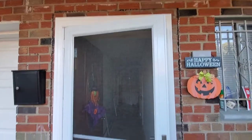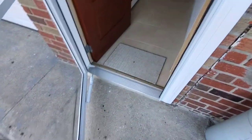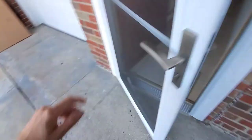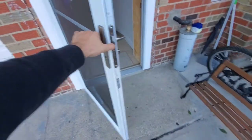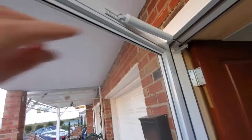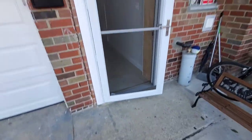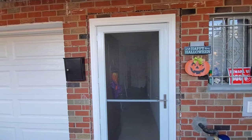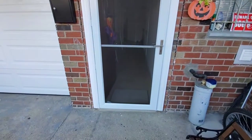Right now the screen's on, I didn't put the glass on yet — I'll try that later. The lock looks good. Final thoughts: be careful with this part of the jamb — make sure you tuck it before you drill the holes so the tongue has something to latch onto. Also, the door does not open all the way anymore — if you need a full opening for a delivery, take off these pins and reconnect after. It's supposed to install in 45 minutes, but I'm thorough, so it took me about two and a half hours. A lot of what I messed up is actually in the instructions — you just have to read it.